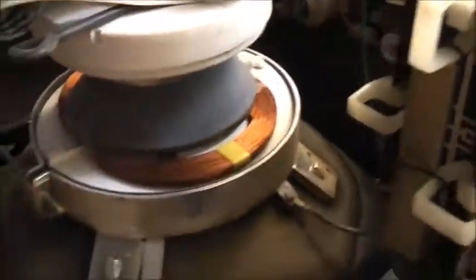So all that popped, that diode was the culprit. That's a power supply board there, and it was stopping everything getting out of standby mode, so to speak. Now I've got to wait for it to warm up, so I'm going to try and get a picture on it now. There's no smoke anymore, it was that diode all along. Alright, let's see if I can get a good picture on it.